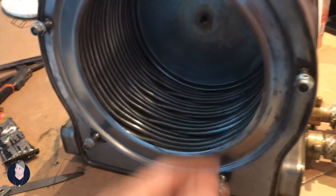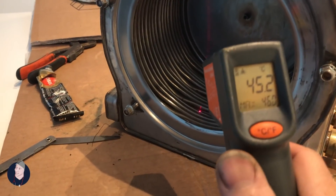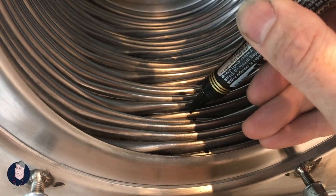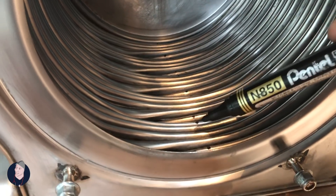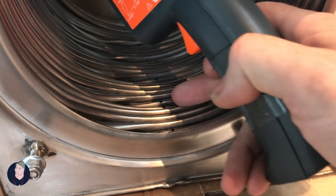So this has been on about two or three minutes and you can already see — look at that. This has been on for quite some time now. I've given it a clean on the inside, it's much cleaner, and this is generating a load of heat. The other one is at 45 degrees — it's pretty tidy now. This is one coil going in, and then it goes out there — that's the out. Five coils — how do we check to make sure we've done what we think? If any of these are blocked, it could have a little bit of flow to a certain point, but at the other part it won't have any flow.